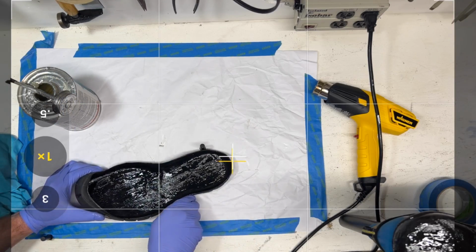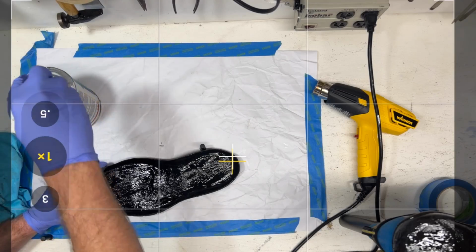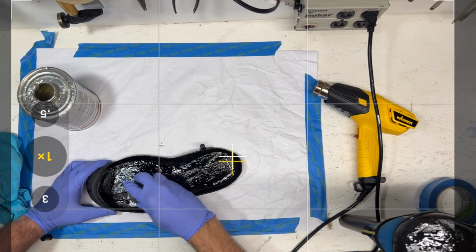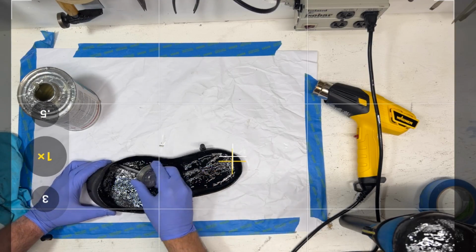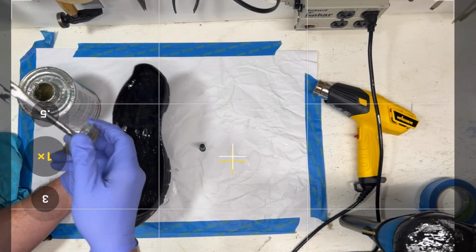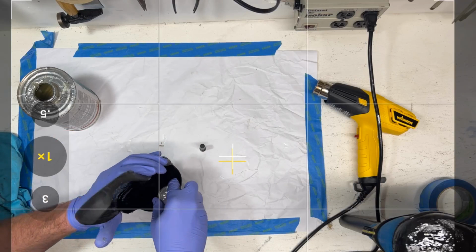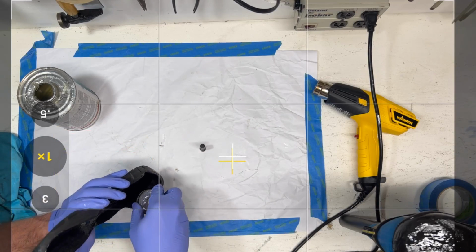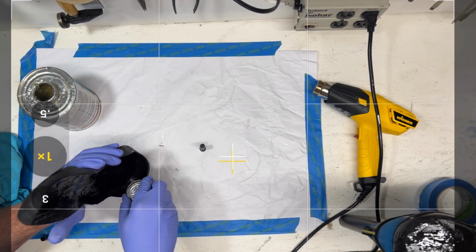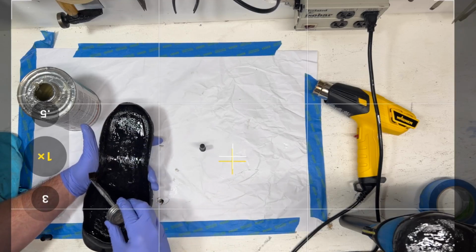But nowadays, when you walk in, you shouldn't smell much glue, because number one, mostly they're using water-based. Now, there are some things where you want to use solvent-based glue. Is solvent-based glue stronger? Can be. If it's a technical thing where it's a safety issue, they're not going to want water-based. But generally, the big brands all demand water-based for everything, and they pretty much have it where there's no difference. What you end up having to do is maybe turn up the heat a little bit on the conveyor lines and slow it down.